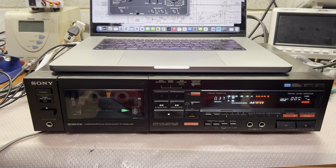It plays really nice, and I would say now it's not so bright — it's almost right there. Let's see the harmonics spectrum. The third harmonic was minus 30 dB before; now it's minus 50 dB. Not ideal, but for this age and this level of deck — it's not a three-head, not so high grade, and it has a little bit worn head — I believe it's perfect results. Sounds good. Now I will record music and check how it plays. See you soon.